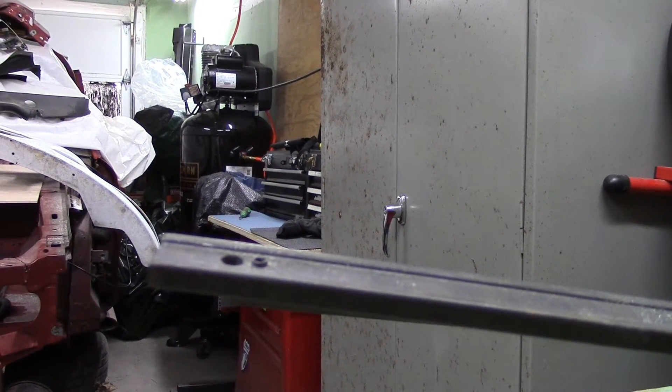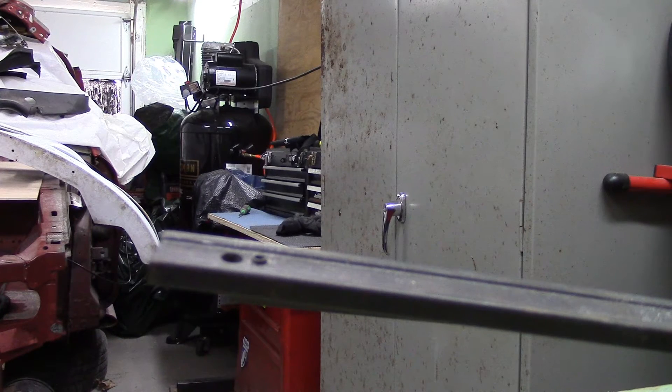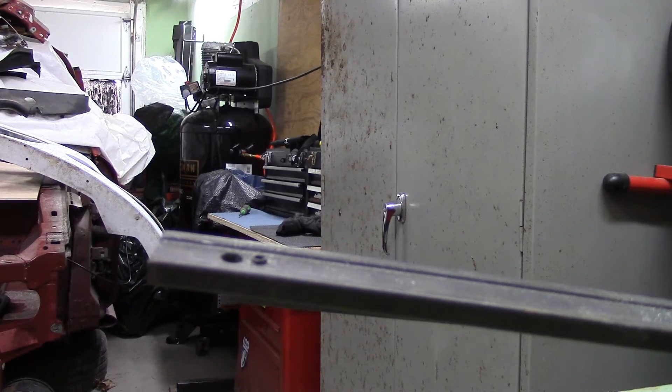Let's see what she does. Here we go — yeah! Tubers, that is how you fix your Craftsman air compressor with a bad start capacitor. Pretty simple fix, $20 repair. My compressor was under warranty, but every time Sears comes out, it's a two-day trip out of work.